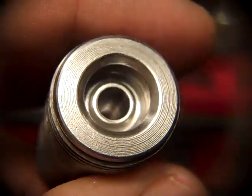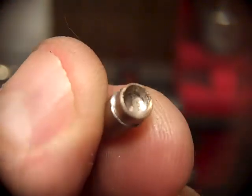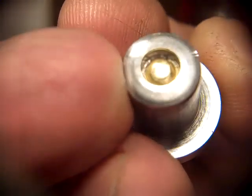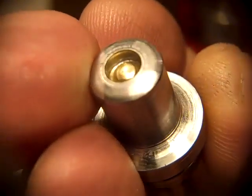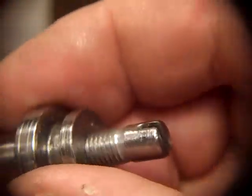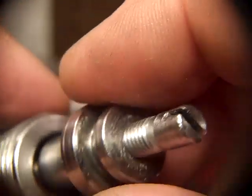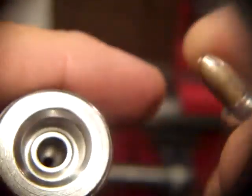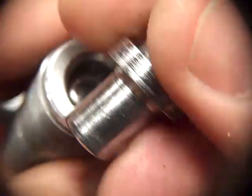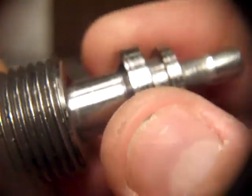Now, because these bullets have a rebated base, or a heel, this die there, it's got the round part. I see there's a little lead in there too. I don't like that. Anyway, that'll squish that, and it squishes into here, and it pushes that in, and the excess lead goes around in that little ditch, and when these guys meet together, you notice it meets nice and tight.